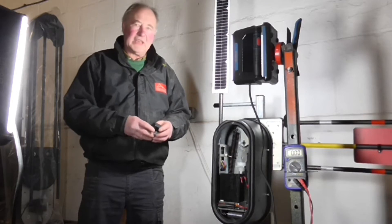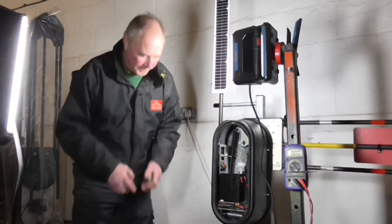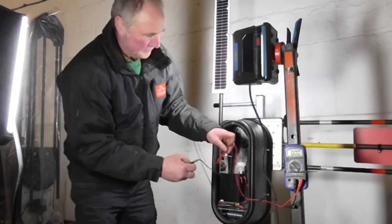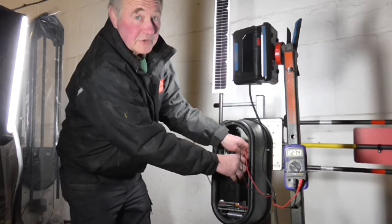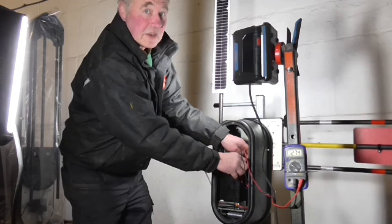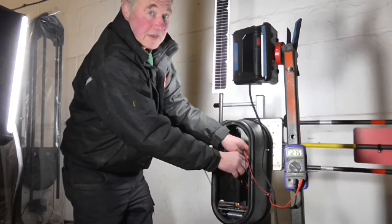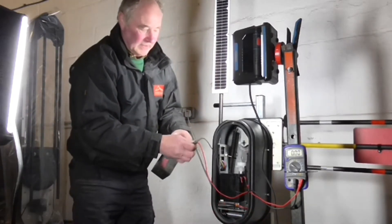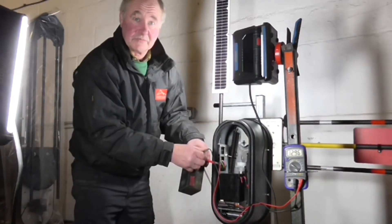One of the major failings of lead-acid batteries is that it's very difficult to tell when they're charged or how much charge remains. Simply putting a voltmeter on tells you very little. For example, the battery in this gate is currently reading 12.73 volts — anything over 12.2 is fine, anything under 12.2 should be charged, and anything under 12 left for any length of time likely means the battery is done. However, this other battery is measuring 12.96 volts because it recently came off charge, which looks good.